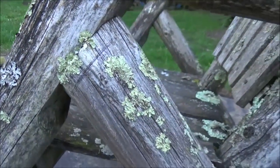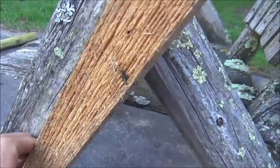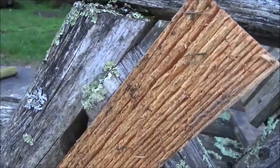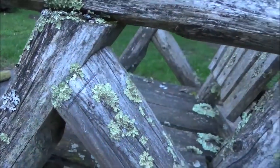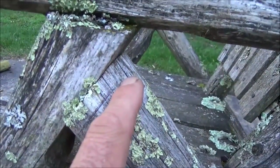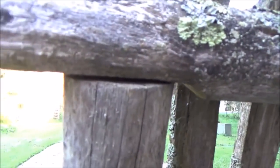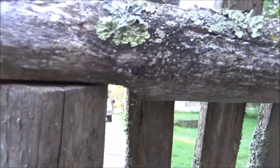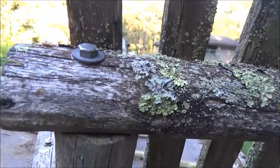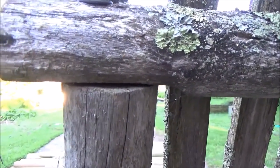You can see that little mark right there. All I did was ran a straight edge up and marked that. Our measurement is going to be from long point down here all the way up to this point right here, and I'm going to do that same thing back here. Just go straight with your little log, go across. We're using lag bolts — I'm actually going to be using ledger locks and it holds it together. There's no reason to flatten that off.